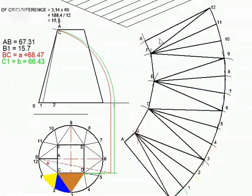So this triangle, this one, is this triangle I'm referring to. We need to stop with that one. So we need to draw the true length of FA, and we need to draw the true length of AB, which is there at 12, so we need to draw that true length, and then we can say we've completed this drawing totally. That will give you the total drawing.